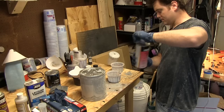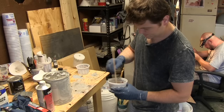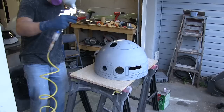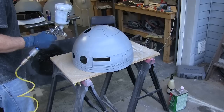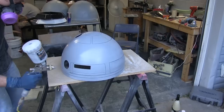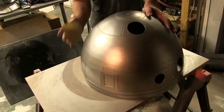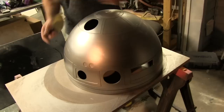Since I sanded it, I'm going to go over it with some more primer before I move to paint. I really didn't have to do this — the composite takes paint really well — but I'm priming just because I only have two days and I don't want to take any chances if the paint didn't adhere properly. This is an automotive 2K primer that is really hard and will promote good adhesion of the paint to the dome. That's a special composite we use. Unfortunately, it went right from primer to silver — Alex got a little confused on the camera, recording when he thought he wasn't, and not recording when he thought he was.